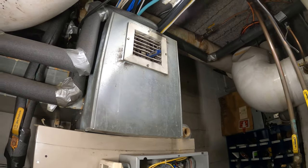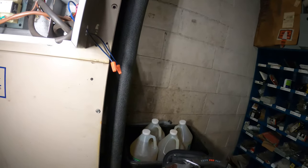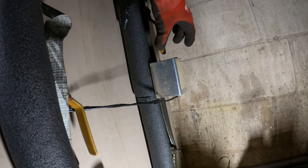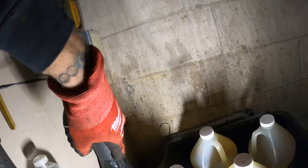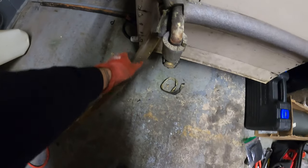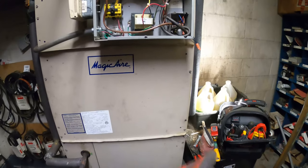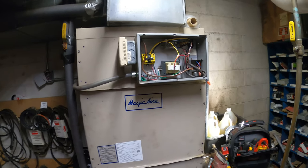We got 69.6 but that's because the chiller is actually off. Over here if we take a close look, this thing is just wide open but it's not doing anything. If you follow this, it's the bypass valve and it's open — so it's pretty much open water all the time. That's why earlier we had condensation and some water here, because this thing is just always on — the water is always flowing.